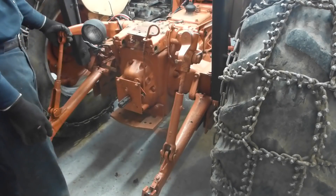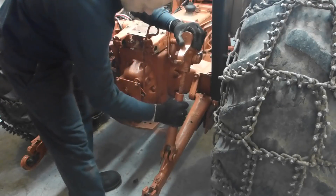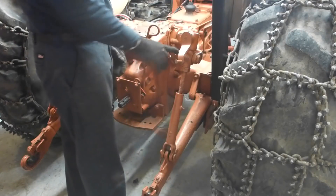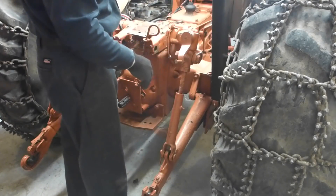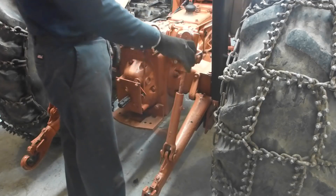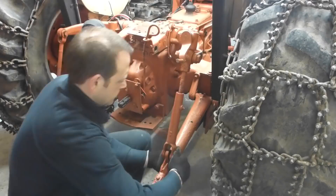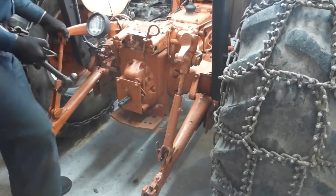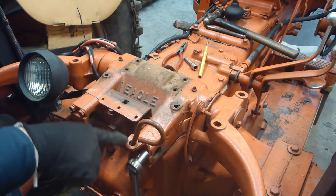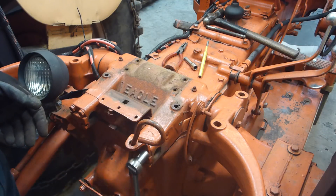I could have removed from here. This one used to have edges to bolt and could swivel, but it seems to be locked in — it's no longer usable. I'm not going to remove those big bolts because most likely they are threaded in that part and probably rusted. I have no advantage to remove them. We'll remove from the bottom. This is the lever to engage the PTO. It's just guided with a small bracket. I have to remove the bracket because when I lift the cover, I'll be stuck with that handle.